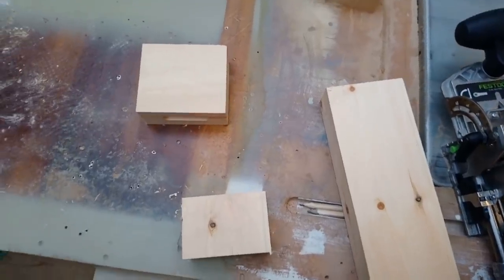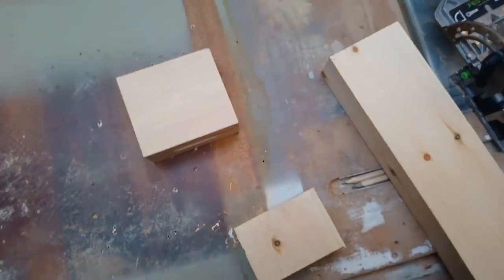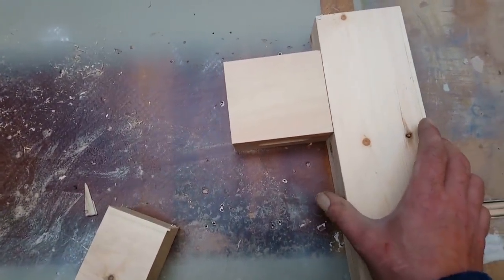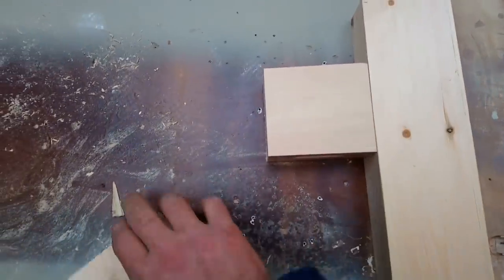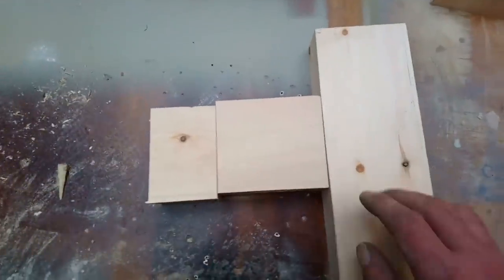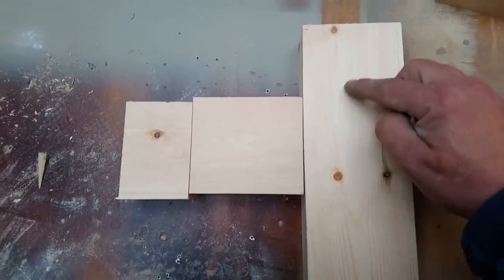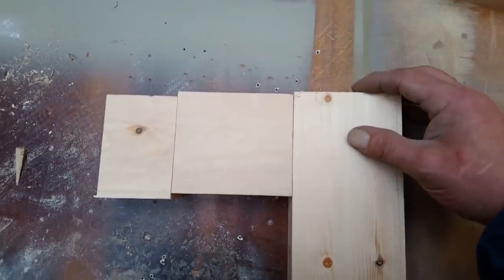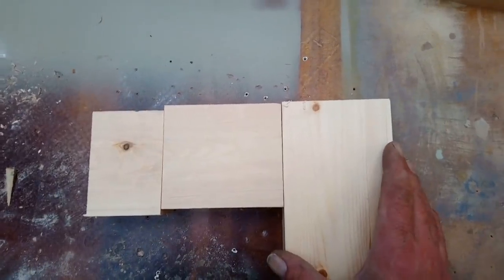I'm just going to cut all the timbers for the doors. I've got my technical drawing in here, height and width, that's all I've got. And normally, imagine that's the top rail, I'd let these legs go through and then 45 the top. That gives plenty of meat for this tenon to hold on to, haunch sort of thing. If I cut it off like that, it only leaves that little bit of wood for the tenon to push against.